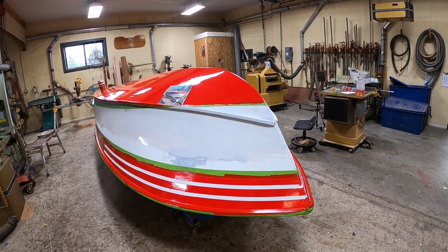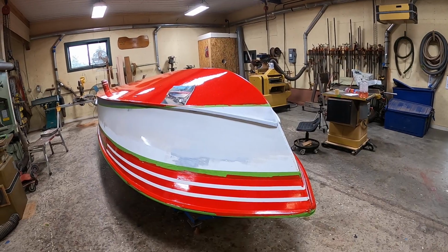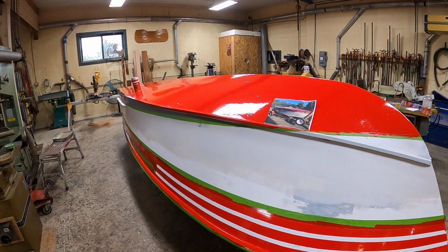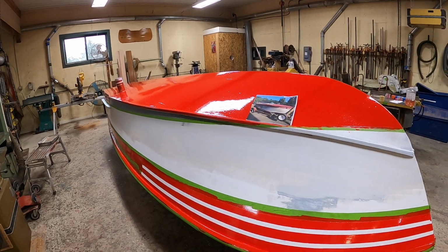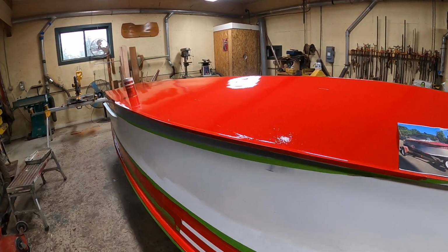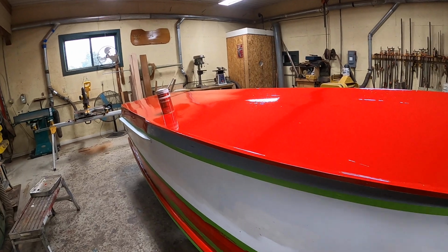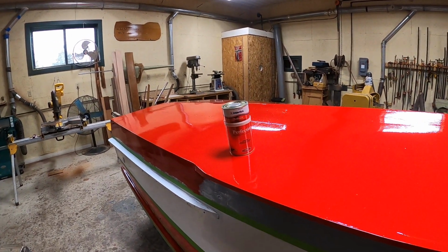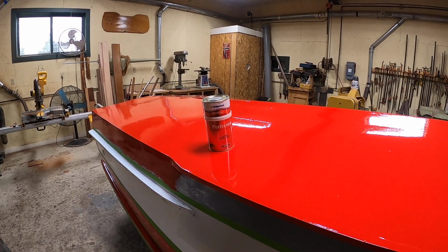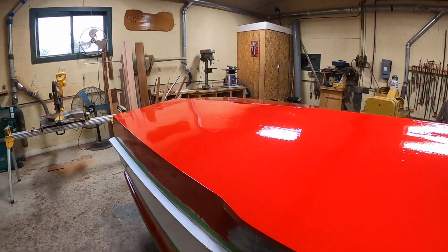And guess what? This milestone update presents her to you emerging in her true colors. She now sports a true 5200 bottom that was sealed with Smith's clear penetrating epoxy sealer and then received 5 coats of Interlux Interprotect barrier coat primer. And Joe has finished applying 4 coats of Interlux Perfection polyurethane, a 2-part paint in Rochelle red. And red she is.